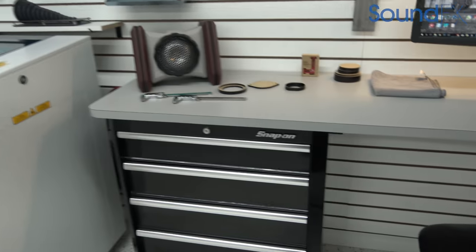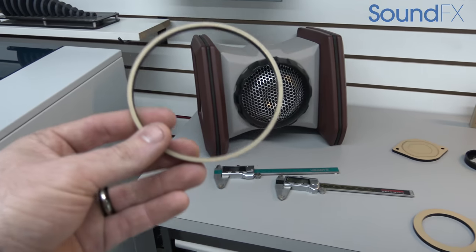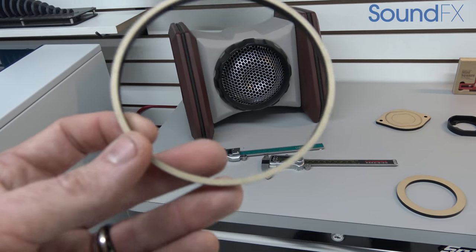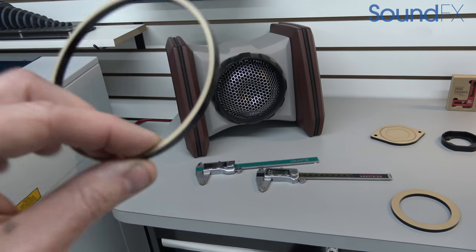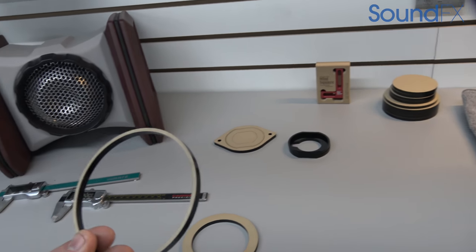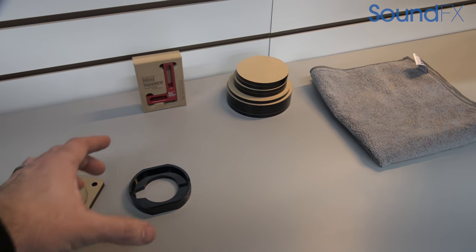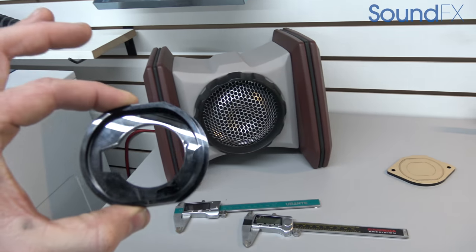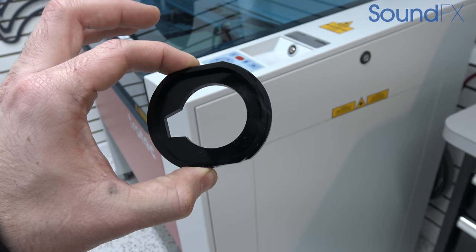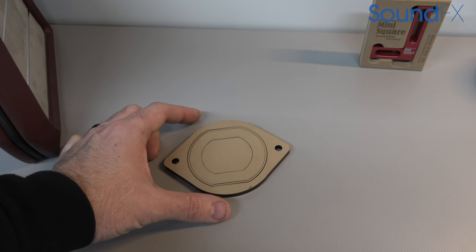We're fairly new to the laser but already it helps leaps and bounds because you're automating the entire process. Before, if I had a new speaker to make, I had to create a shape by hand from scratch on a router — which is not only realistically dangerous, but it's a pain. Something like that can now be done in seconds on the laser, start to finish, completely cut. Your parts database lives in your computer — if I need a Focal Utopia tweeter, there it is: two pieces, glue them together, a back plate and a trim ring. If I want it deeper I cut multiple trim rings. If I want that shape in a Toyota speaker adapter, there it is.